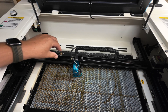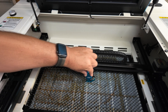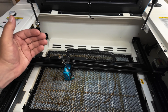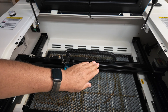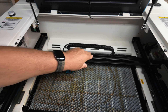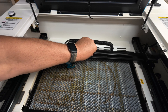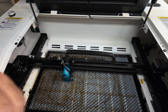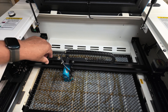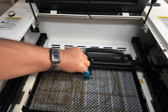Explained as best I can in my own words: gantry style lasers such as the Bolt are designed to run that laser head up to a thousand millimeters per second horizontally, or side to side, across the gantry. These units are not designed to engrave very well up and down or vertically. Instead of the head speeding across the gantry back and forth on rubber wheels, you're moving the entire gantry back and forth. Although you can do it, it's not recommended because there are tolerances and settings engineered into the electronics that are more geared to having the head floating horizontally.